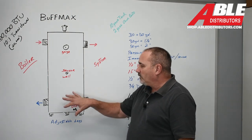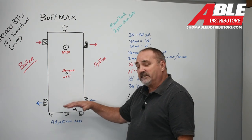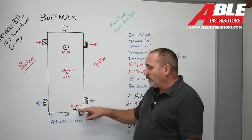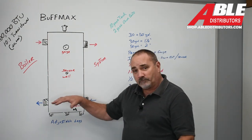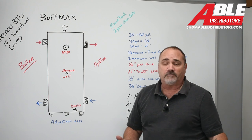We do the cold water return on the bottom — similar idea. When it comes in here, we get a pressure drop, so the water starts releasing some of the dirt and debris. There's a drain right at the bottom, a three-quarter drain. So having the drain and the debris fall out from the bottom and the air bubbles come out from the top just makes sense.